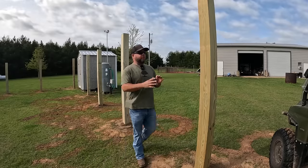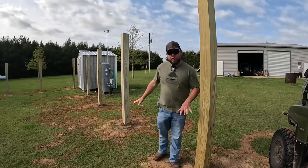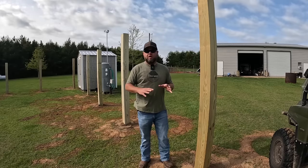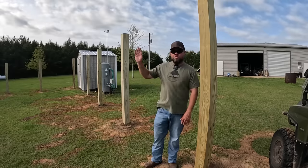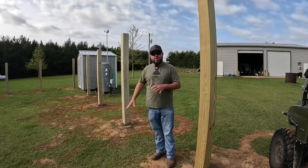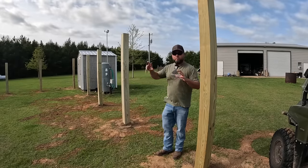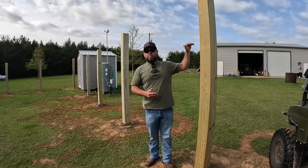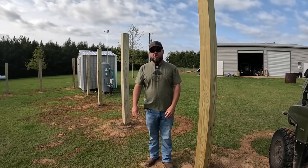Let's have a discussion about these horizontal runners that we're about to put up to nail our fencing to. If you have perfectly flat ground it's going to be so much easier, but I do not. There's probably 16 inches of ground change from this post to the one across over there — a pretty significant increase, so we're going to have to be trimming our panels. I had to figure out how to get a level reference line on all the posts to measure everything else off of, so our posts are cut off at the correct height and our horizontal runners are at the correct height all the way around.